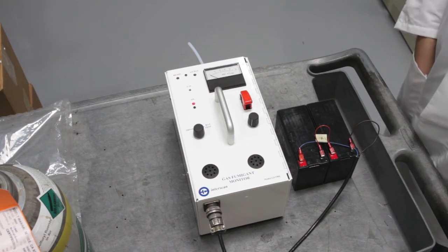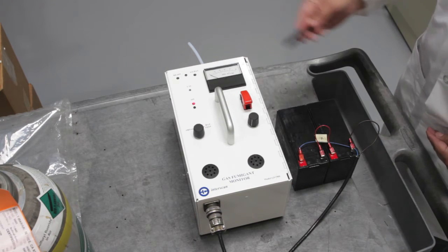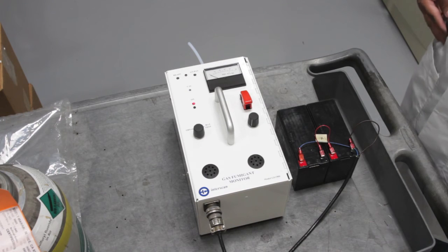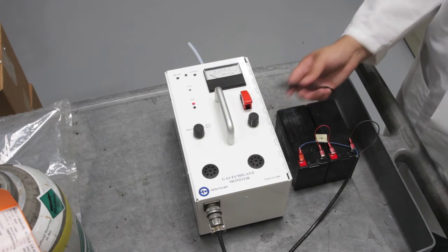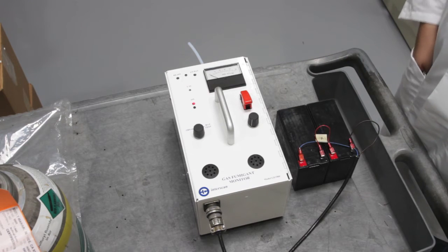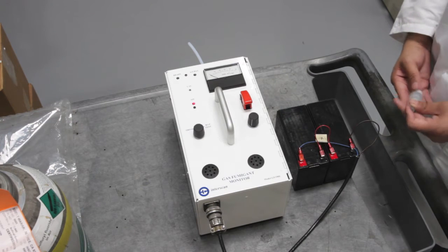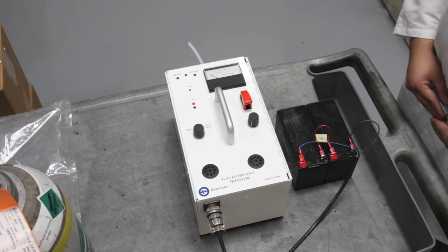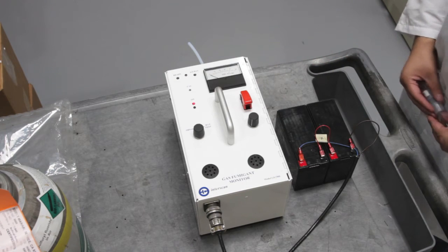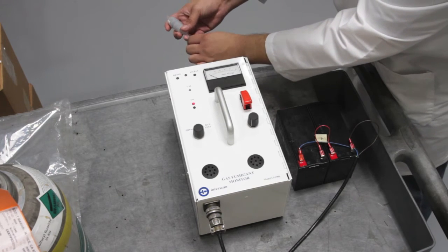With the unit turned on and sufficiently warmed up, which should take approximately 7 minutes, and once the ready light is illuminated, zero the analyzer with the zero control. If zeroing in an environment which may have other cross interferences, a zero filter should be used. Contact Interscan for additional information. When using the zero filter, connect the zero filter to the inlet of the analyzer.